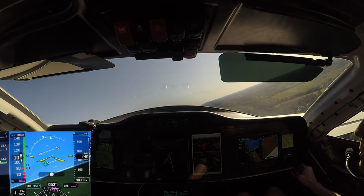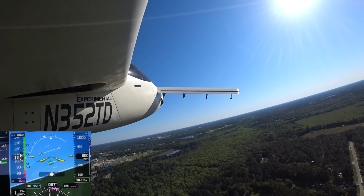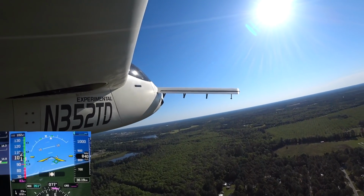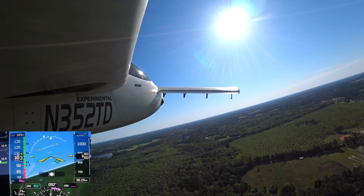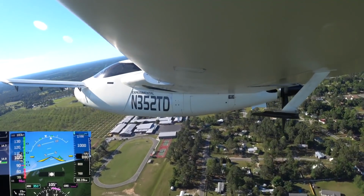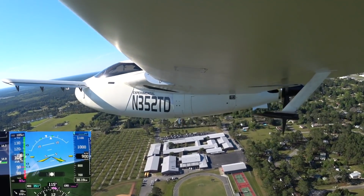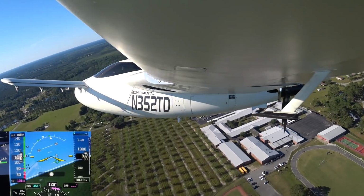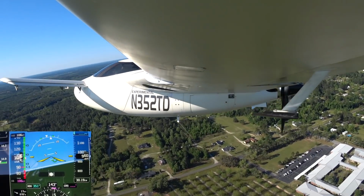That's mainly for me to see if any improvements can be made for airflow under the cowling, because I was a bit concerned that there's heat build-up around the redrive now that I've got those vents open on the side. And you'll see I've got a larger lip now on the cowling around the spinner in order to draw more air. It seems to be working okay, but obviously airflow is something you can keep tweaking forever and make slight improvements.